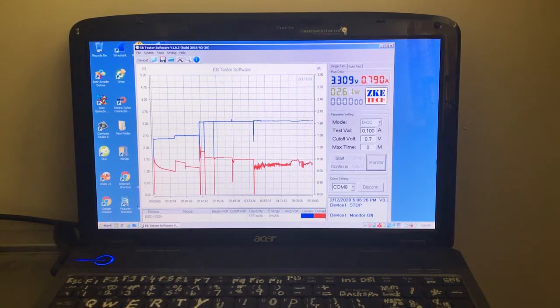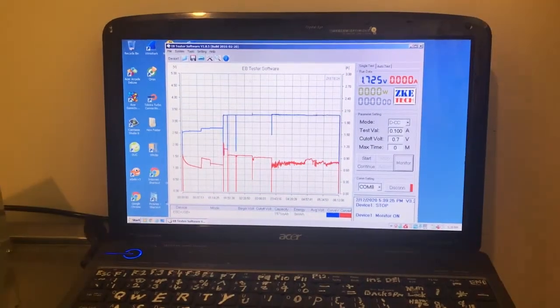Fingers crossed. So I'll get back in a half hour or thereabouts, and we'll see if it actually can do 100 milliamps. I think the original cell didn't do 100 milliamps until about, 1, 2, 3, 4, 5, 6, 7, 8, 9, 10. Oh, I kept it at 50 for 20 charges. So yeah, alright, I'll get back. Okay, it's been on charge for 6 hours and it's holding 1.7 volts at the moment. So we'll see if it can actually run 100 milliamps for its first run.